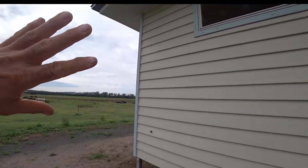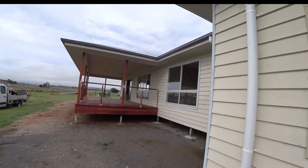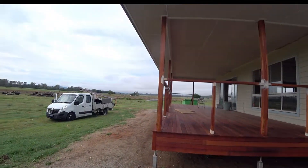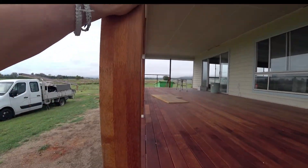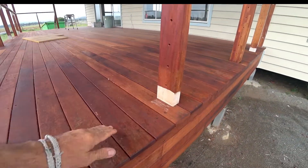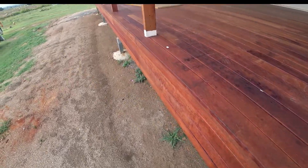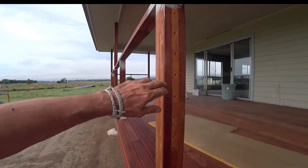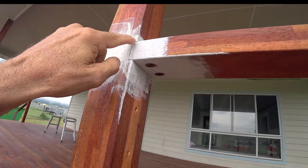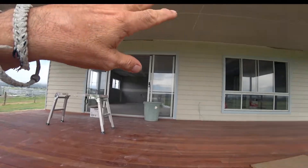Today I'm just going to set up with my planks and ladders and I'm going to putty and gap all this outside. The plasterer has been inside and he's sanding off - they've still got to do the cornice yet. We're going to paint these handrails and the post, and put a stain on here - a natural DWD Ultra Deck. This will be an Ultra Deck as well. They're going to be putting the wire balustrading in here. You'll notice this builder has primed all the back edges - very important. We've got weatherboard all up there as well to do.